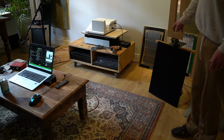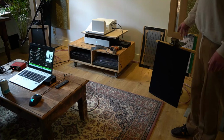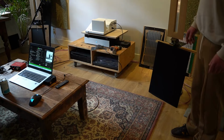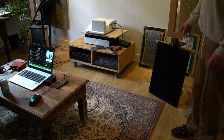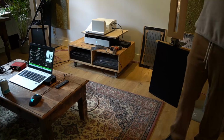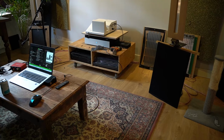and I added a notch on both resonances of these panels. This one minus 8 dB, or 7 dB because it's slightly damped by the fabric. That one minus 11 or something. I think this one even less. It's also less annoying because it's a lower frequency. So 50 hertz is quite an annoying frequency that I have to damp even more because my room already gains it. So if I got 9 dB from my room and 9 or 10 dB from the panel, that's going to be outrageously ugly.